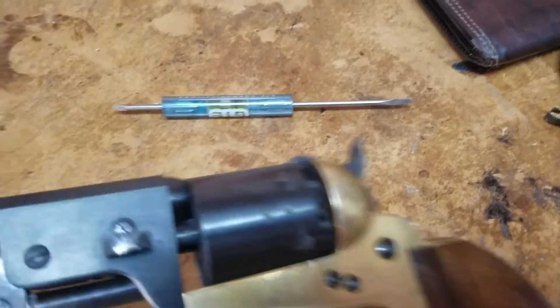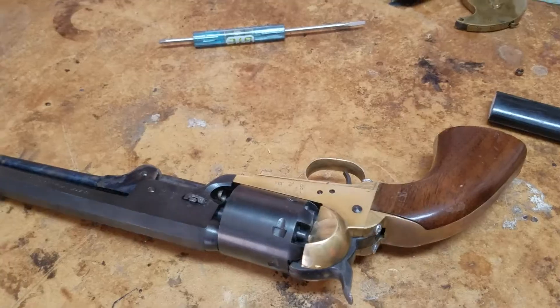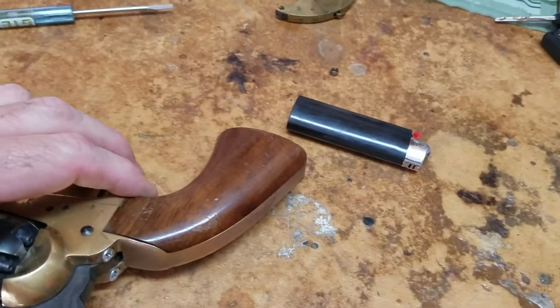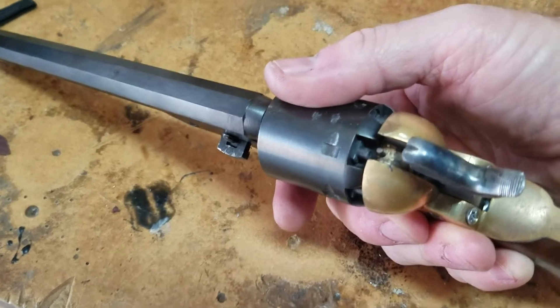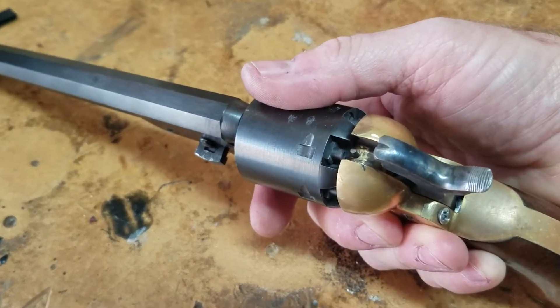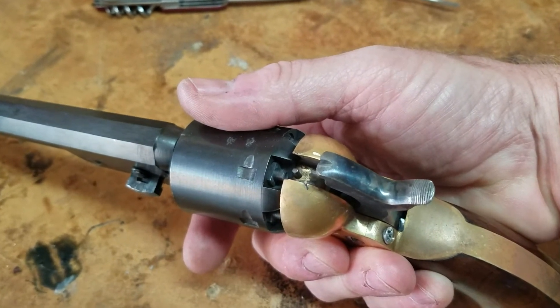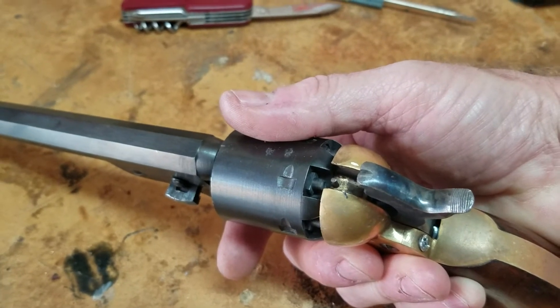This is an older Euro Arms gun, so it's a little odd. It says it's Pietta, but some of the same things don't fit, like the main spring and stuff. So anyway, what I did — let me put it in half cock. I don't know if you can see that little pin right there. What I did was I drilled a 3/16th hole. What I had read was people would take the end of the 3/16th drill bit and put it in there, but I really didn't find that worked too well. It seemed to be a little weak.